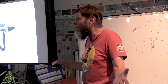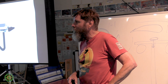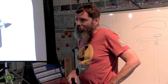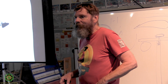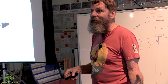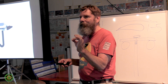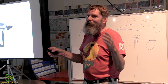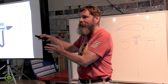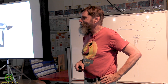We can stick it out there and see if it does anything — the investment is not that great, and that's the good thing about it. Essentially that's it. Figuring wattage out, it's all basically in the data sheet. If you've got 310 watts available, you have to choose a motor that has something less than that. Unfortunately, with the nature of electric motors, a 310-watt panel can't drive a 305-watt motor — you generally have to give it about 80% leeway. So a 250-watt motor with a 310-watt solar panel would be fine. Are there any engineers in the group that might want to comment on this?